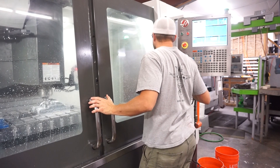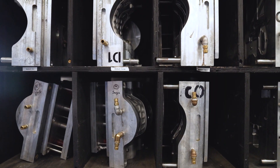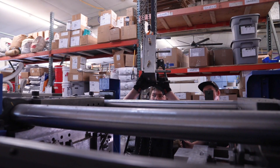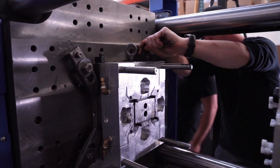So how do we do it? First, we manufacture specific molds out of giant blocks of aluminum to house the parts. We do this in-house, like most of our manufacturing. Then, we lower the mold into one of our two injection molding machines. They are super heavy, so we have to use a gantry to install them and take them out.